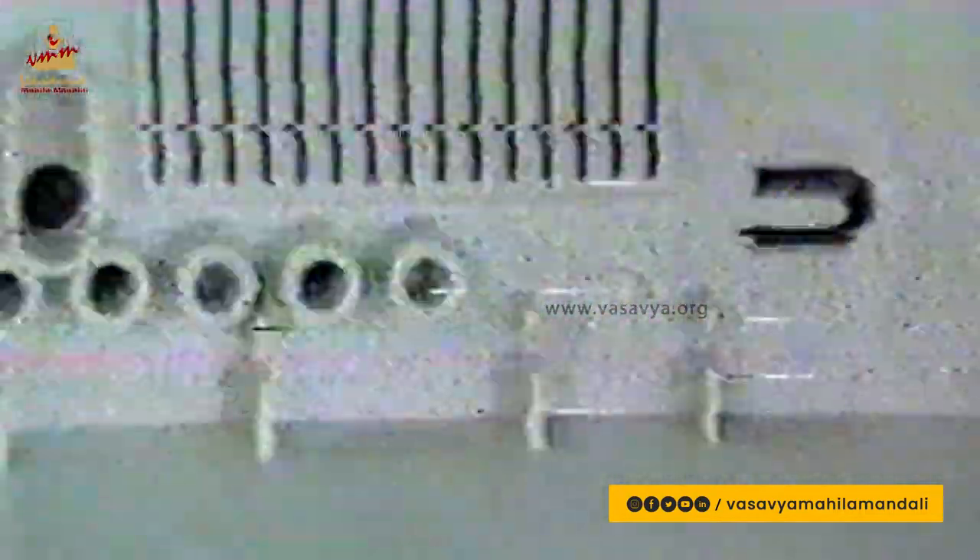The main printed circuit board is held in the moulding itself — the moulding has guides and slots to accept the main PCB so it gets well anchored in place. The rear cover of the cabinet also has corresponding slots so that when it is fitted, the printed circuit board gets firmly gripped on all sides by the moulding itself. This feature avoids hardware mounting while at the same time giving full support to the printed circuit board to withstand shocks and vibrations during transit.